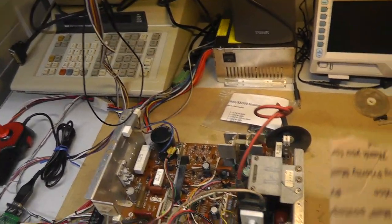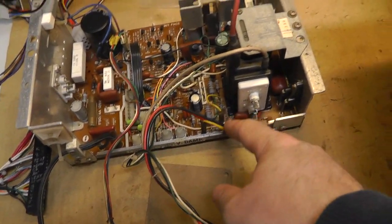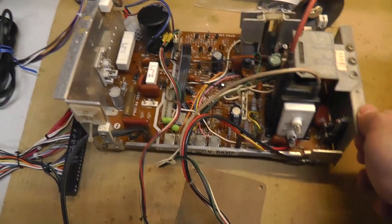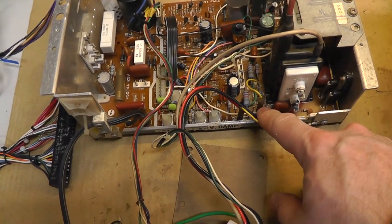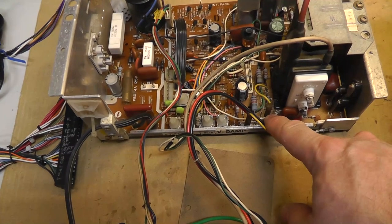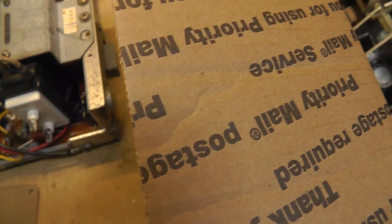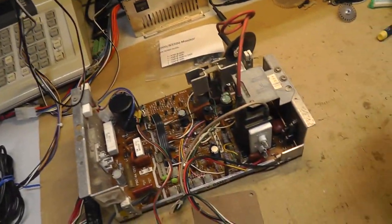The other thing is that the documentation of these Wells Gardner Arcade 4900 says it is a 4903 chassis. So this is another reason why I believe this is a 4901 out of a Williams game. A 4903 doesn't come with this horizontal centering post right there. That's usually deleted. And this looks like another 4901. Sorry about that, moving the camera around.